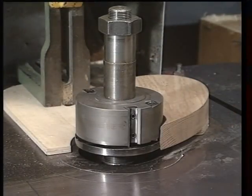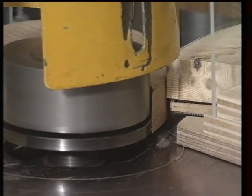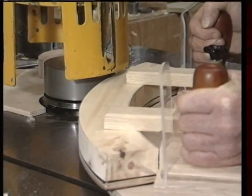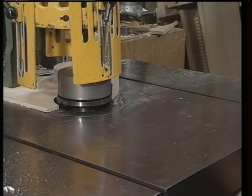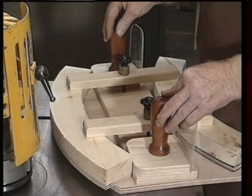The bearing and block have been fitted and adjusted to the correct working height. A suitable lead-in piece is installed. This prevents kickback at the beginning of the cut. And now we're ready to make the cut. Before you start the machine, carry out the safety checks. Remember your cockpit drill. The jig is suitable for machining both convex and concave shapes.